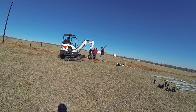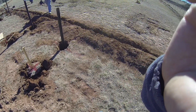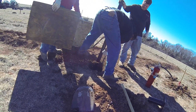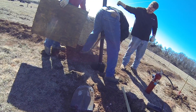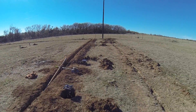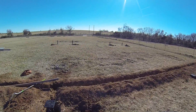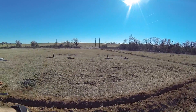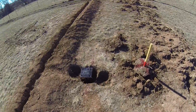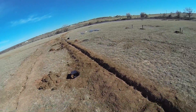This is number eight — the last one. We got all eight piers in and they're all different heights, so now we're going to cut them all to level. With all eight piers done and leveled, you can see there's quite a bit of slope — the caps are about a foot and a half to two feet higher than the closest-to-ground corner.